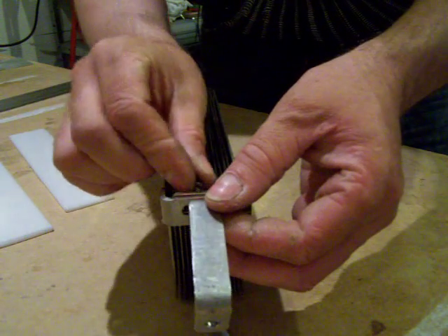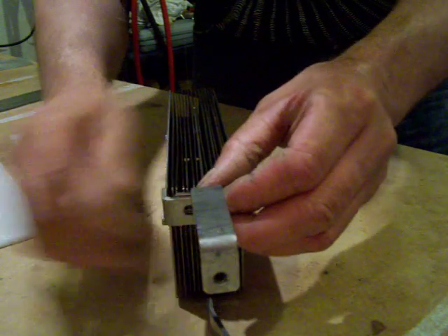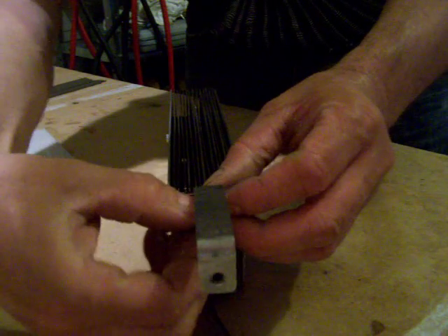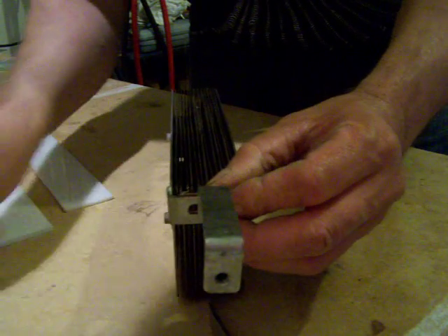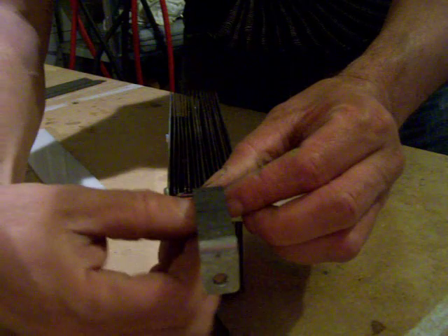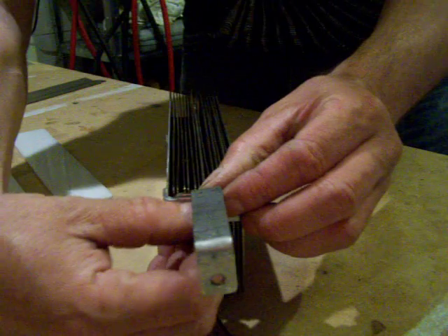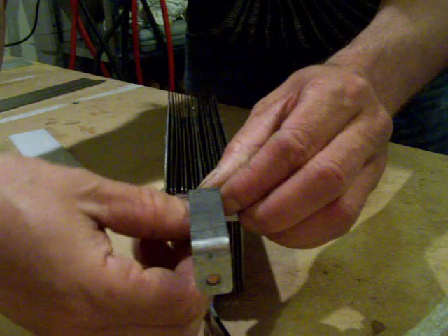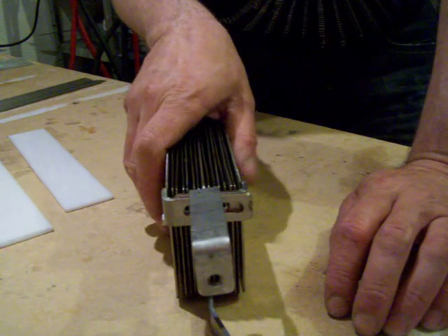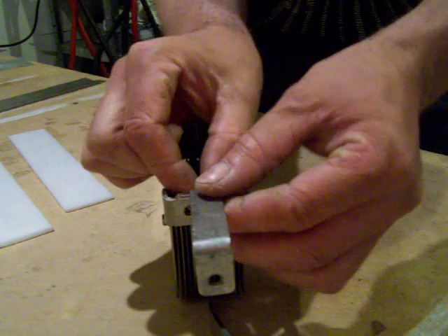I have worked with stainless steel for 26 years, and I know that in 1 to 2 millimeter stainless steel you only need 25 amps to weld it. So with this unit running at 40 or 50 amps, thin connections can't hold — they can get too hot.